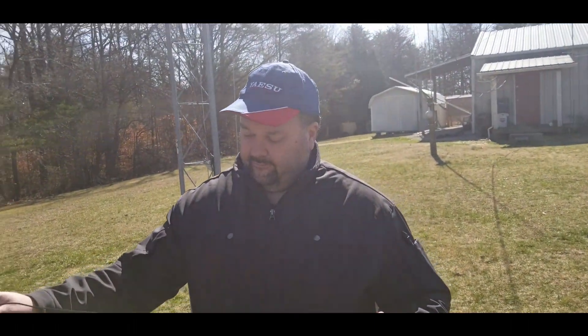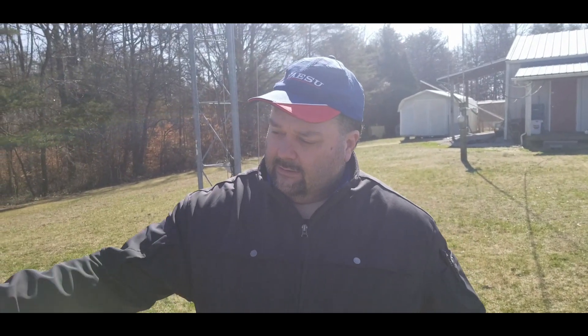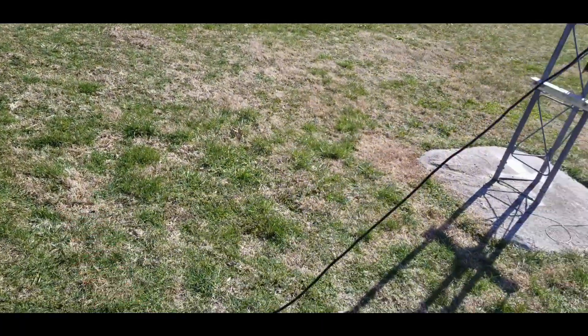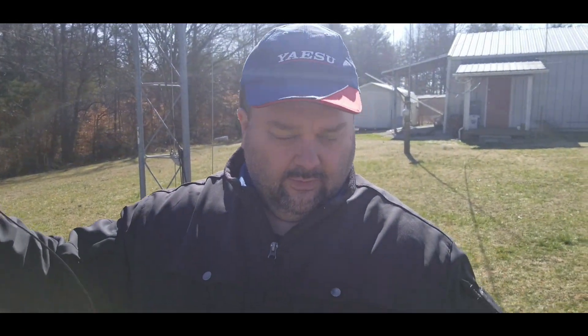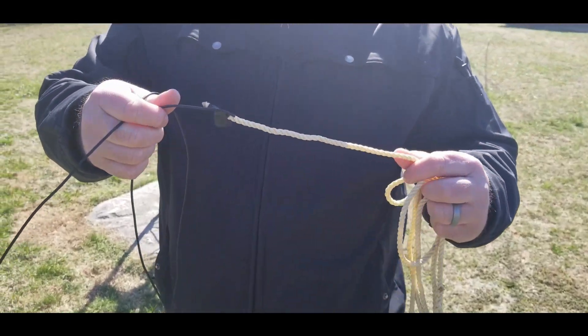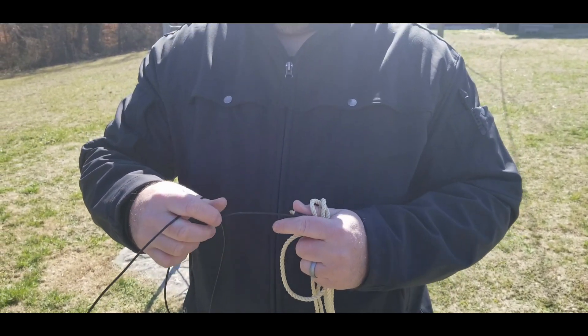We're starting part two of the link dipole project. KY4CKP, Chris, what have we done so far this morning to get started? We've got our pole set back up for a consistent platform. We've got our first link in place, and we've measured the next distance from the center point to get to 20 meters this time. We did 10 yesterday, so we're going to the next link, which is 20, and keep working our way out towards 80 meters. We've got some temporary line on here so we can get everything off the ground, and we're going to check the SWR — put our pole back up to its proper height, test it out, do a little fine-tuning, and put in the next set of links.